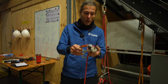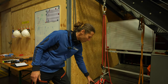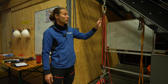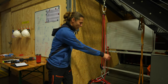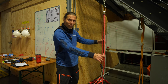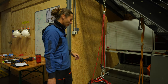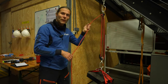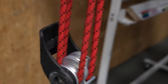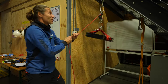I rigged it up right here below me. I have a 50kg weight — two pieces of steel at 25kg each — and I rigged it as a 4-to-1 with a change of direction from the top. Because of the swivels I can orientate the load; the swivels move around so the ropes are always free to move and not sliding against each other. I lift it up and you'll hear that familiar sound dubbed the 'sound of progress' — we know it from the clutch. I can lift it all the way up and ram it in there.